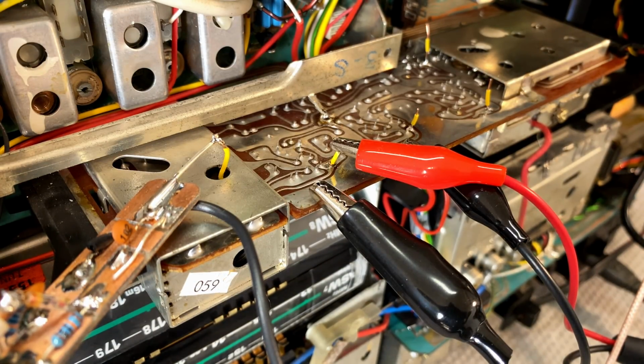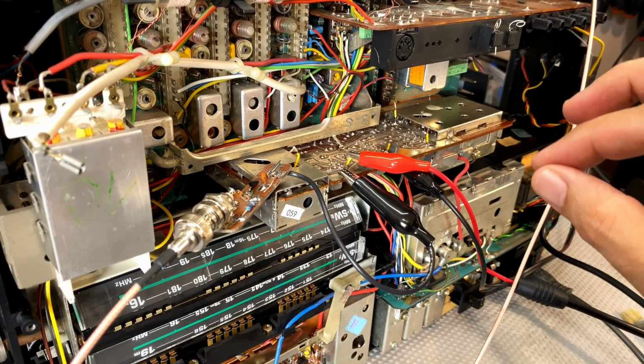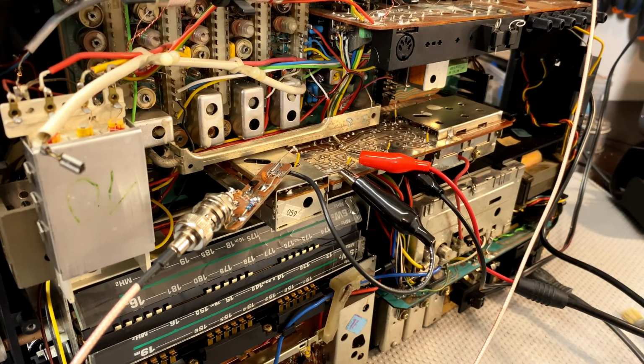And now, what do we have coming in here? The signal generator is bringing in a sweep that starts at, I think I've got a span of 600. So the center frequency is 10.7. I'm starting at 10.4 and ending up at 11. Is that right? I'm just checking this. No, I've got a span of 400. I start at 10.5. I stop at 10.9. And I'm doing this in 280 milliseconds. I want to talk about that time in a second.